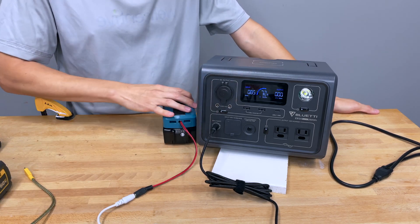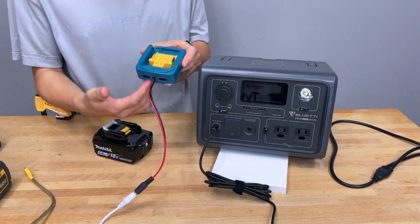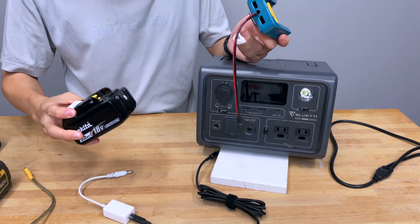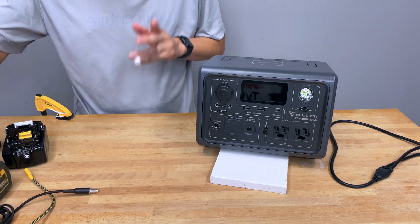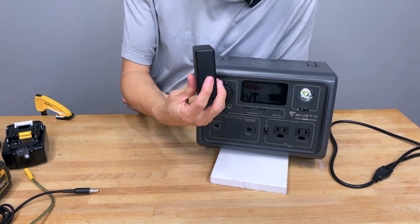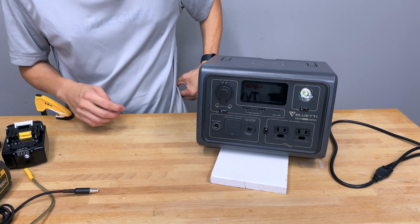This Makita setup is a little unsafe right now - this thing is not fused, and the circuit board I literally just took out to make this happen. There are no smart battery controls, so low voltage cutoff - I don't have full confidence that's going to happen inside this battery. I wouldn't do this if you had a choice not to. You can also use the AC port to charge, and you can use both at the same time, but if you're out in the wild and can use a wall outlet, that defeats the purpose.